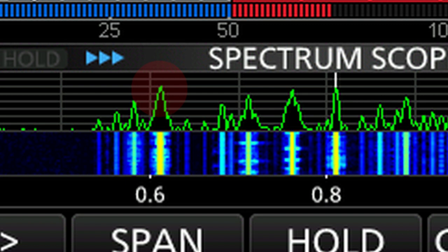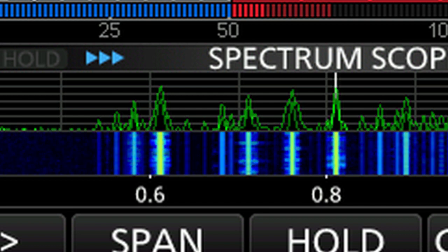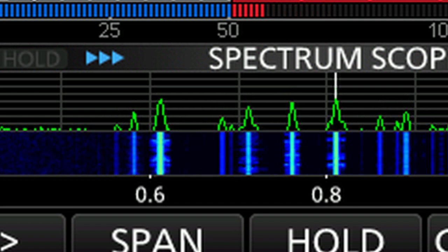Now let's take a look at this next screen capture, which is the same setup except I have the medium frequency attenuator on. On this one, that same station that was above 600 kilohertz — you'll notice that it's about halfway between the third and fourth line, just not quite halfway up. So if we compare that to the first one, this would be 10, 15, just about 16 dB down. So it looks like the filter is pretty close to the 16 dB they advertise, at least on the rig's own scope.